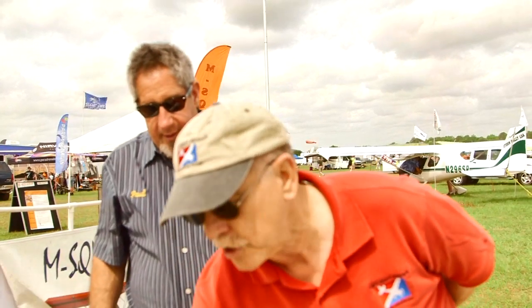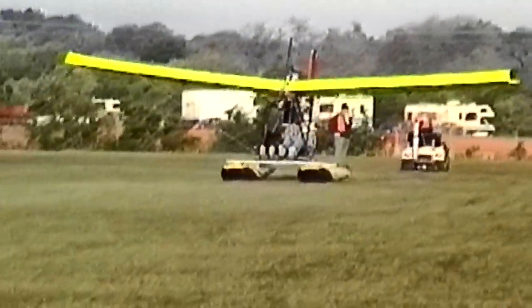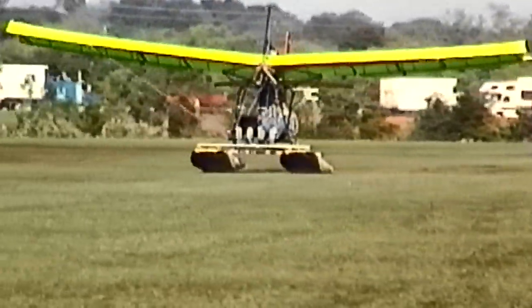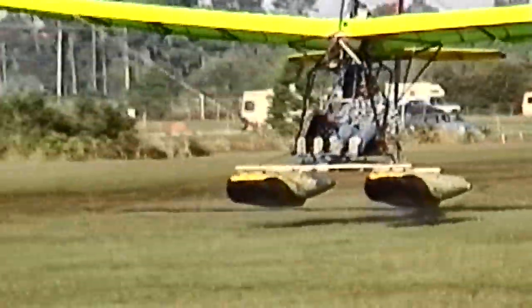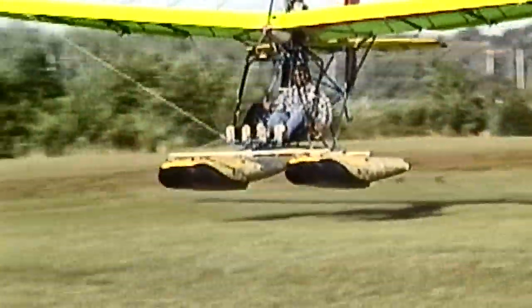For those who don't know the Lotus float: the bottom has hard plastic about a half-inch thick, molded — so it's like a rubber ducky boat. The air sacs are at only two and a half PSI, which is why you can push in on them fairly readily. But they look secure, and they give a cushion as you're taking off — it's a shock-absorbing system.